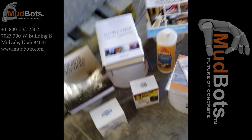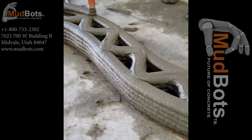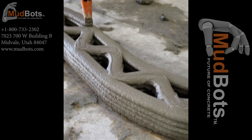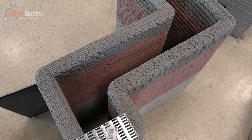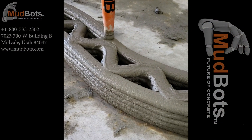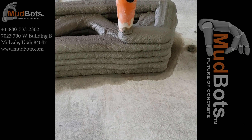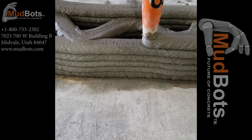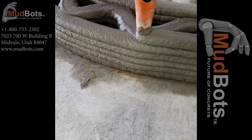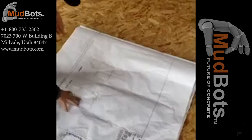Those characteristics are going to determine exactly what the engineer needs to do to print a home to meet spec — whether this wall is going to be 12 inches or 4 inches, whether it's going to be a hollow wall or have internal mortar support like this one right here. Once the engineer says it meets code, the test results from your mortar support how he designed the specific structure — the exterior walls, bearing walls, and interior walls.